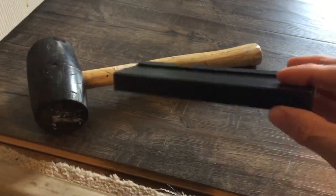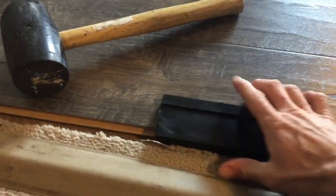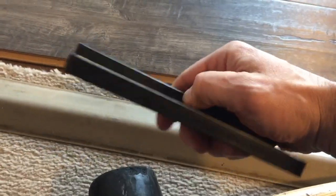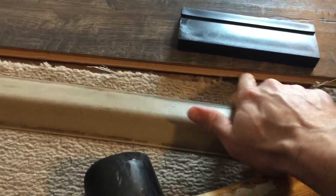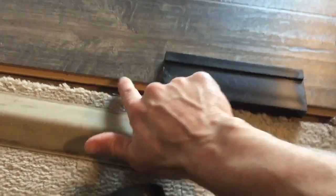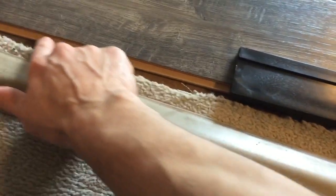The other tool you could use is this one here — you can set it on the lip of your wood, it doesn't matter which direction, and use this to tap the wood all the way in. The benefit of using this over a block of wood is that the block of wood could damage your lip if you're not careful. This tool only puts pressure on the solid board on top of the laminate, so it keeps you from damaging the little lip groove that you need.